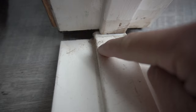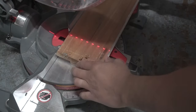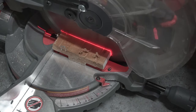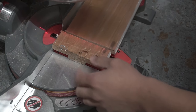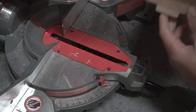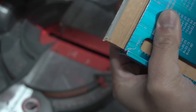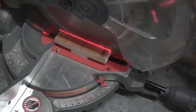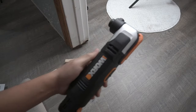If you put the new piece right against the old one you can see there is a gap of about a quarter inch. You want to start off with a clean edge, so with my old door jam I'm just going to cut off the ugly edge — you can see there are still staples on that end. If you don't have an extra door jam piece like this, just use regular plywood and measure up the sizes you need. For this one I'm cutting about an inch to match the gap.